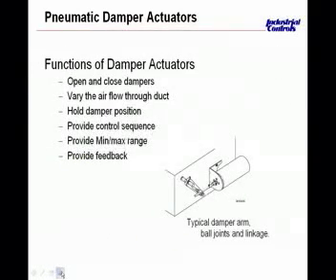Here's a simple depiction of a damper actuator. There is a linkage between the actuator itself and a crank arm on the damper. We like to think of the damper really as just another type of valve, but for air. This damper might be a two-position damper interlocked to an exhaust fan on a roof, or part of an economizer scheme or a relief damper where we want continuous modulation. These damper actuators are inherently proportional — the two-position or modulating nature is a function of the control, not of the actuator.